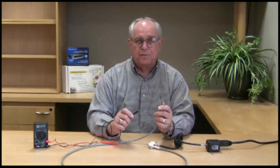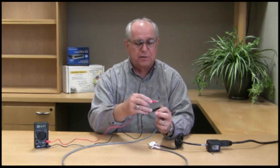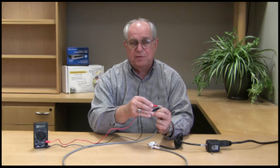Finally, one last thing to check is our cable connection out at the amplifier or amplified antenna to verify we have our 15 volts DC. Put the black lead on the outside of the connector, the red lead on the center conductor, and we should have our plus 15 volts — to verify we do not have a bad connection or bad cable preventing voltage from reaching our amplified device. If we have voltage at the end of the cable and the device still does not work, then we have a problem with the amplified antenna or the preamplifier.